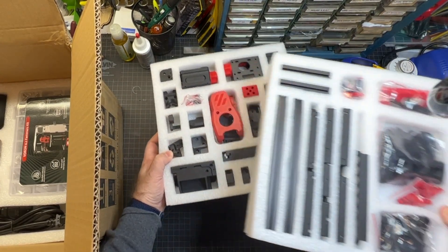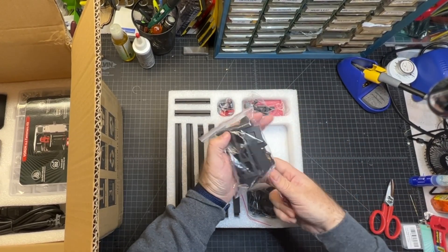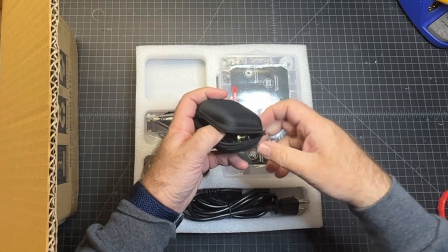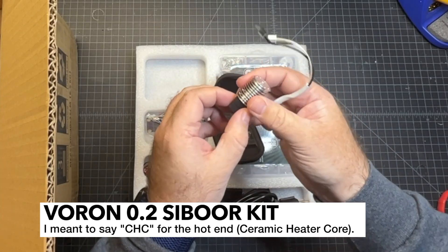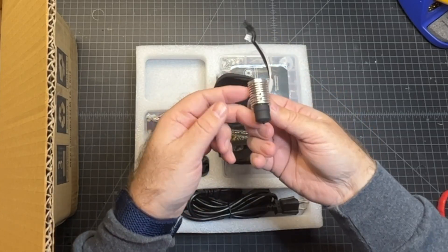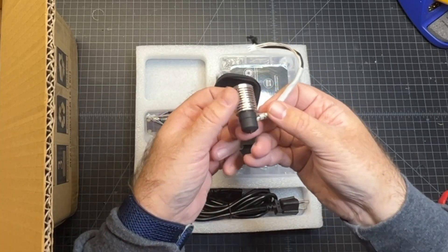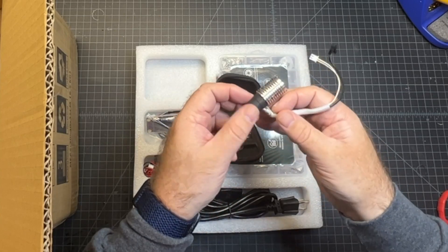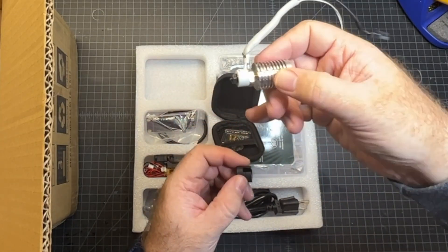What I really like are these trays — this is really nice and organized. We've also got parts for the screen here and here's all the panel clips. Oh, this is the hot end. So I understand this is a type of CHT — it's basically like a kind of Revo clone I believe. It's got a hot end sock on it. I don't have any experience with this hot end but I do know that it's similar to the Dragon and it even uses the same mounting holes as the Dragon hot end. In terms of flow rate I plan on doing some benchmarking. I also believe this is a V6 nozzle.